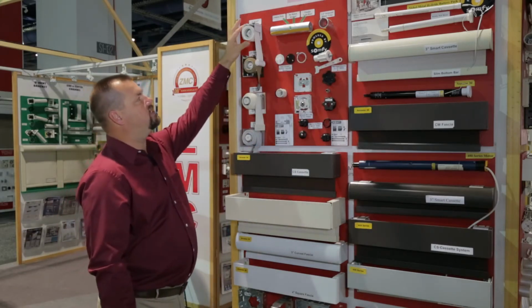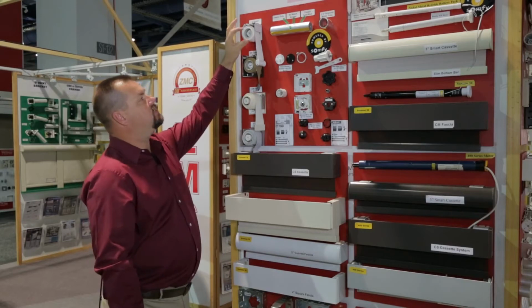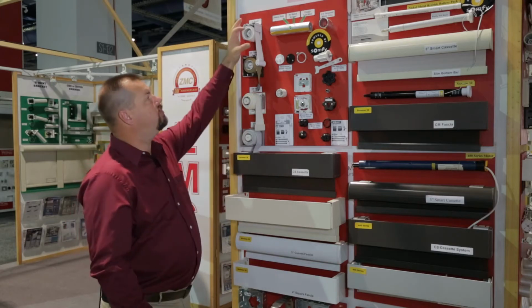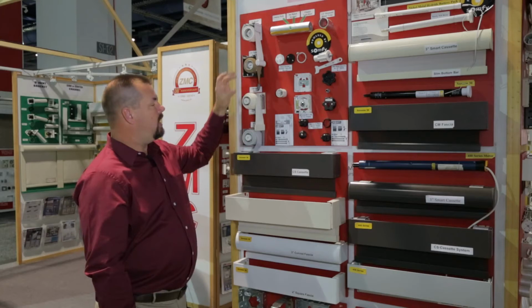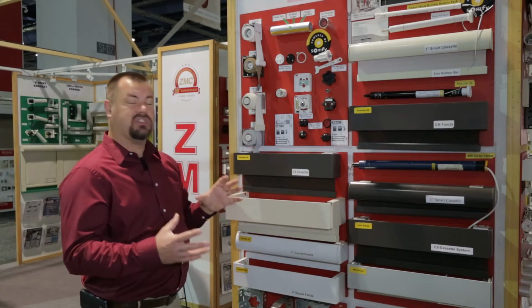As you can see here in this small 3-inch fascia, the roll-up diameter of the fabric itself is what determines the size. So here we've got a small tube and a large roll-up diameter. The wider you go of your shade, the larger the tube, the less room you have for fabric. So you have to go to a larger and larger and larger. So the bigger your shade, or the larger the motor that you need, the larger box and cassette that you need.